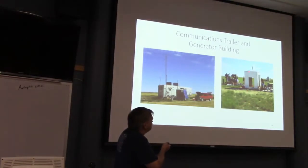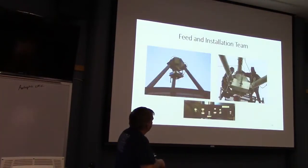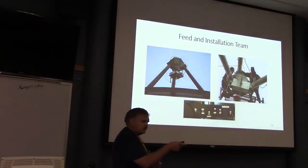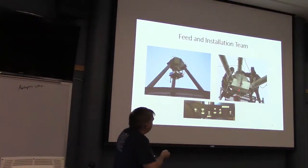This is our propane generator that you guys put together — it was all on propane generator and solar power, and we recently got a grid upgrade. This shows how we install feeds: you climb up the tower and install the feed. This one happened to be a dual-band VHF/UHF, hydrogen 1420 MHz, 1296 MHz — 432 and two meters — two-way, tropospheric, EME, etc. We had that up for a while and have since switched to a single feed.